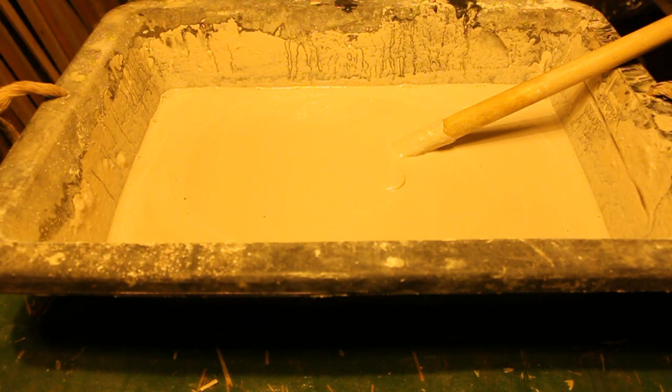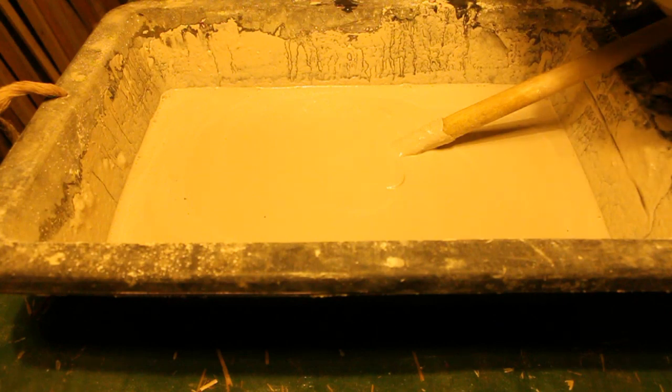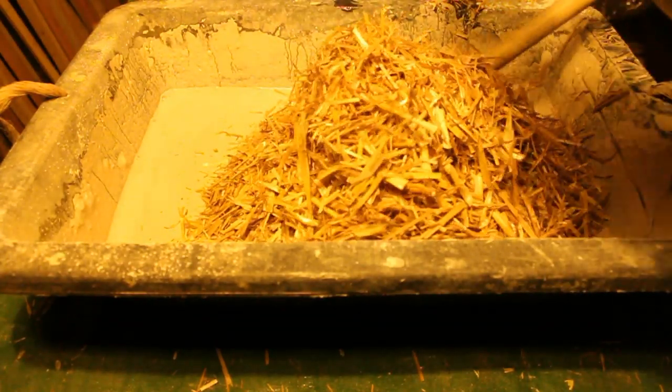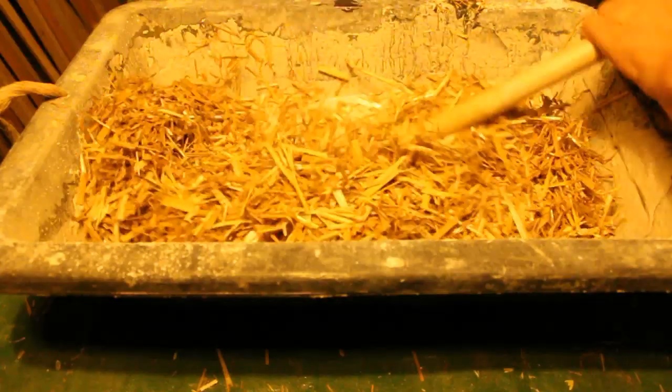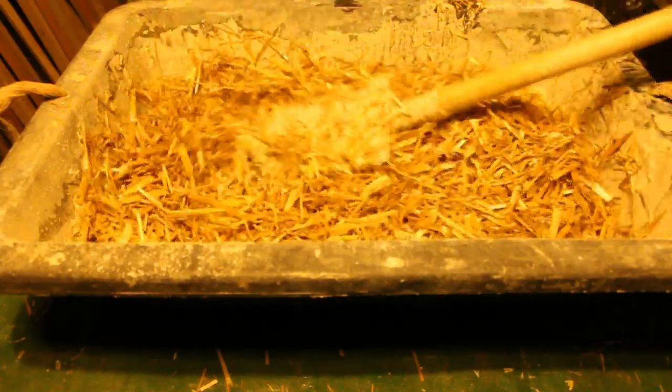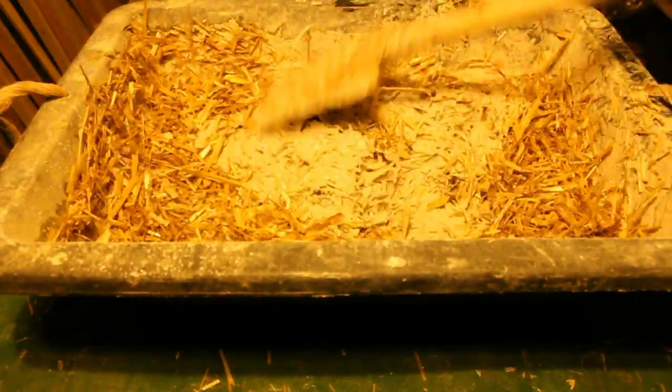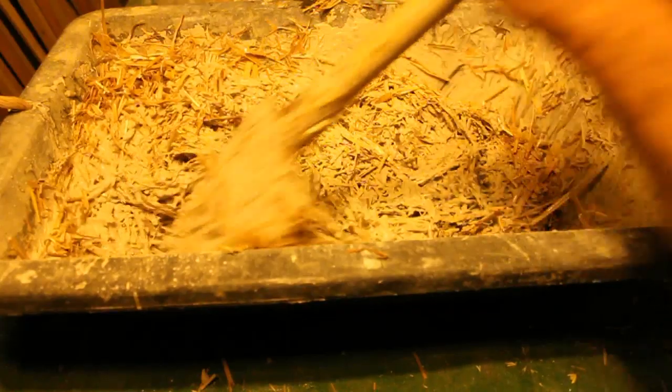When I've got that and I was happy with it, I then add the chopped straw little by little, stirring at every stage, just mixing it in until the whole of the straw is coated with the lime. Eventually you get to a point where there's no liquid left and all of the straw is covered with the lime. I've also found what's useful with this is as it coats the straw, the straw softens so it becomes a lot more usable, user friendly — it's not as stiff and you actually find it will go into a mould much more easily.